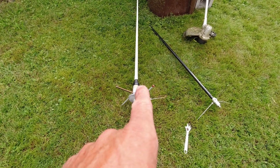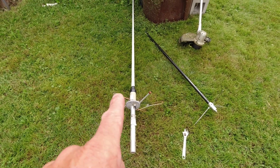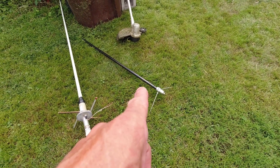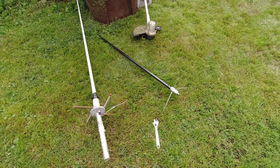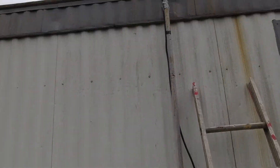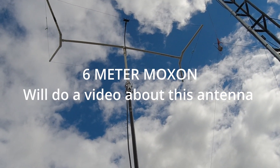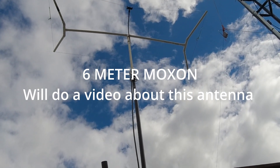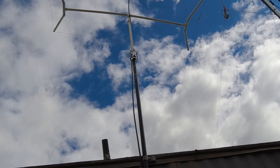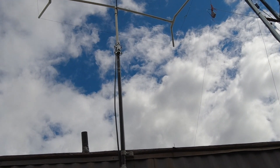Let me show you what I've got. The antenna on the left is a commercial GMRS antenna. The one on the right is a Tram 144/6B dual band — two meter, 70 centimeter. And there it is — the 6 meter moxon. It was pretty simple, wasn't too difficult to build. SWR is like 1.5 to 1.6, which I'm not going to worry about. I'm going to run it that way.